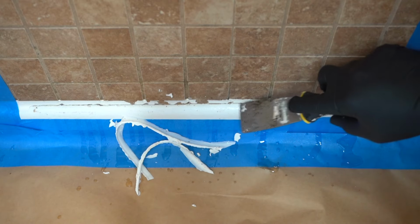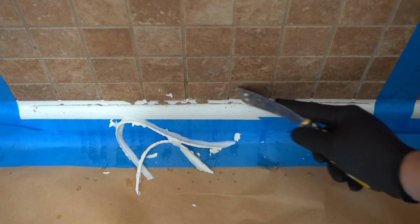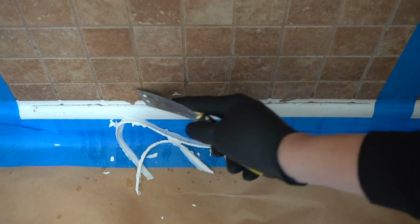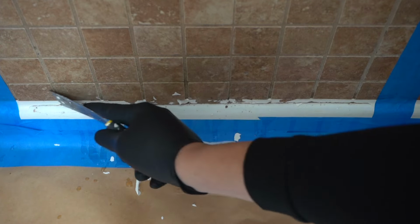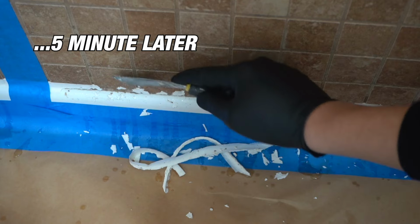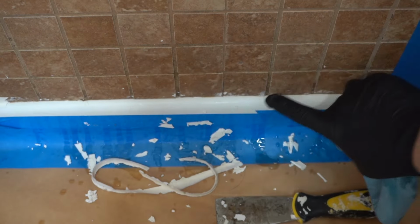So this caulk remover is really good when it comes to silicone or latex that is attached to your shower pan. But tile, it's doable. It might take a little bit more elbow grease to take out, just like the De-Solve It. But again, it says in the instructions you can always reapply. So I'm going to give it one more go. Wait 5 minutes. Good thing it's only 5 minutes. This is my last resort tool because it gets the ones on the tile a lot better. And we do still have a little bit of residue left.